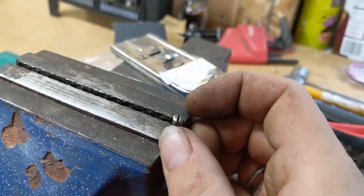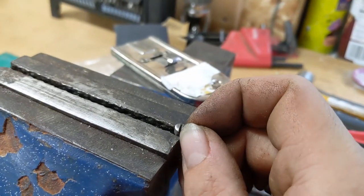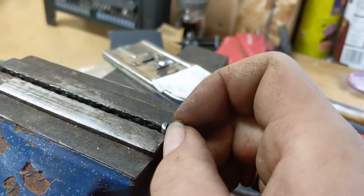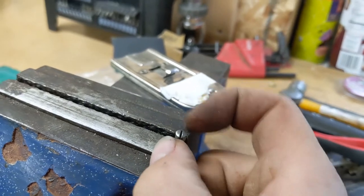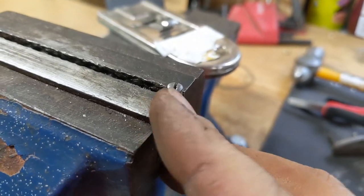One thing to do when you're pulling screws out is to use a screwdriver that's the exact diameter of these, because if it's undersized, it'll just start hourglassing in, and if it's oversized, it will catch on the adjoining surfaces and just blow these corners out more.